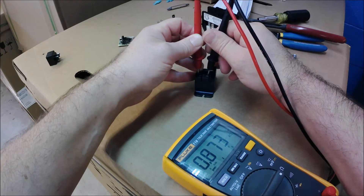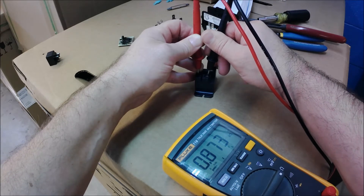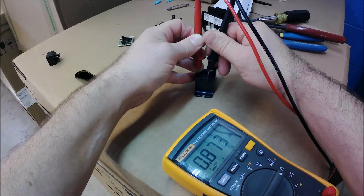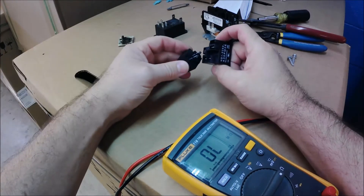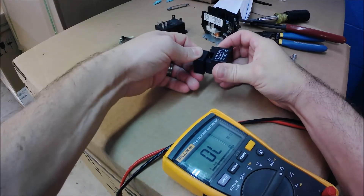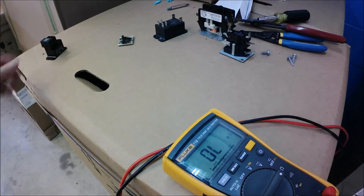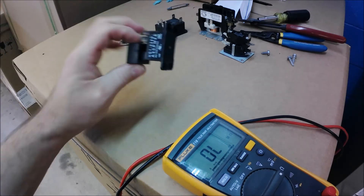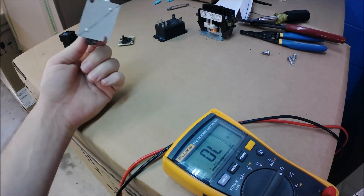That's a much bigger number than what you'd traditionally see on your 24-volt AC components like a contactor or a transformer. But you can still ohm it out just like any other relay. If you take that heat sequencer apart you're going to see it's not a traditional coil of wire. So you can still check it the same way.